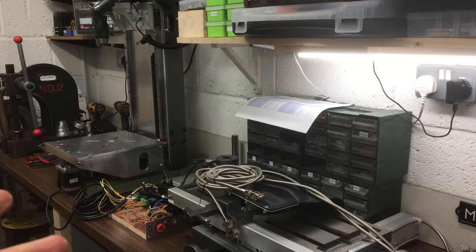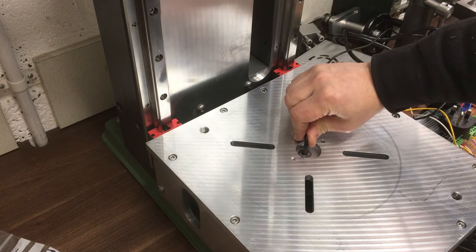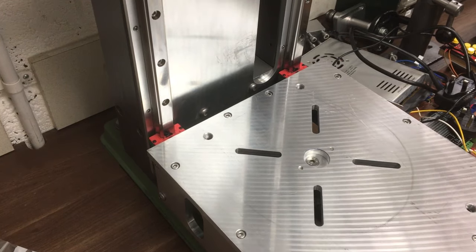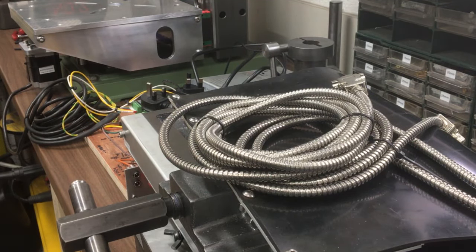Okay, I think we've got to the point where we can put the XY table back on there. I've just tightened up the bolt that holds the knee onto the ball screw, because obviously if that starts coming undone, it'll be hidden by the XY table. So that's really tight now. Right, I'll film it from here so I don't kick the camera over this time.